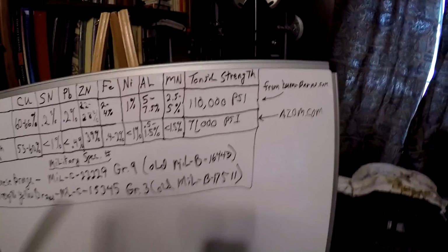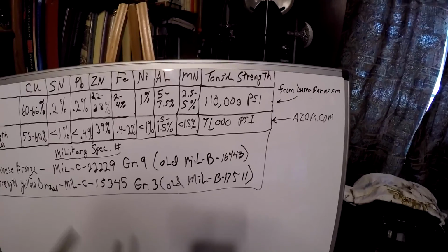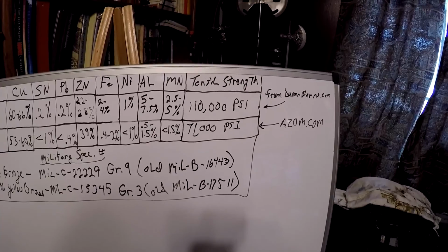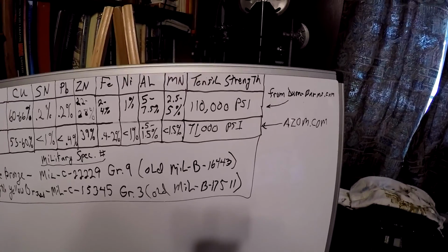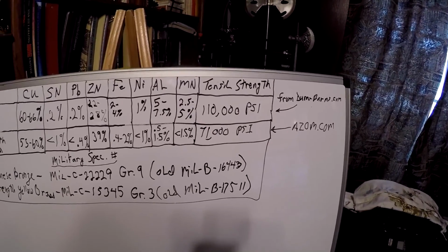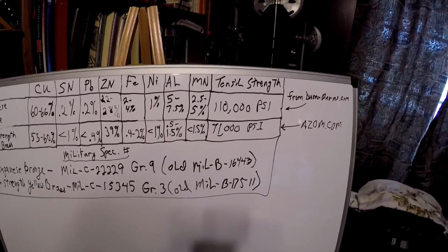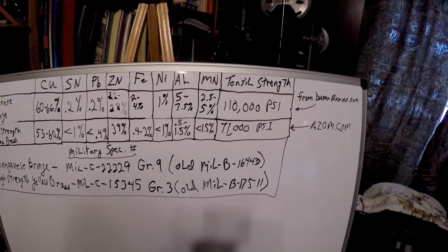Now, we also know that ferrous materials, and I'm not talking stainless steel, which is very expensive if you're a foundry, will be stronger, but their corrosion resistance was crap. As soon as you start putting ferrous materials underwater, or even above water but surrounded by salt water, the salt in the air, the splashing of salt water on the ship when you're underway, it all starts corroding it right away. And if you don't want it to corrode away before its projected life, you're going to have to add things nearby, like zinc plates,